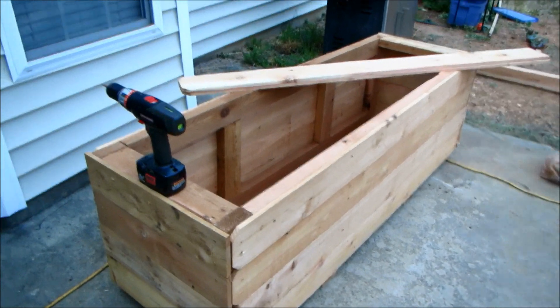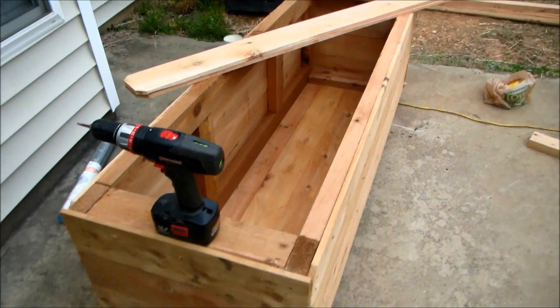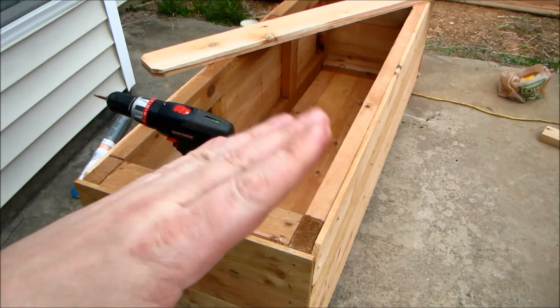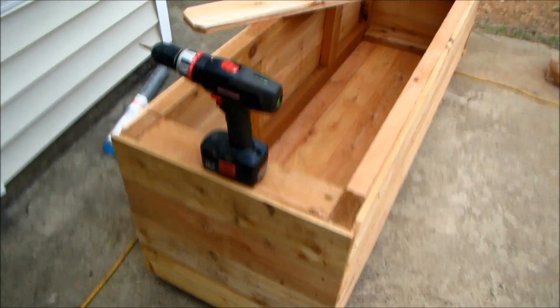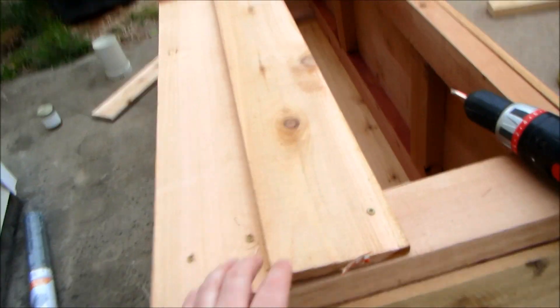These boards are only 23 inches, so I'm not totally worried. If I run into problems I can always run a two by four out later and reinforce it. I'm going to do the roof design next — I'm going to do the roof on a pitch so the water will actually repel off. I'll show you pictures of that in a minute.